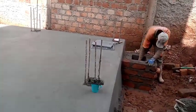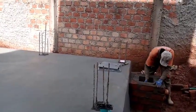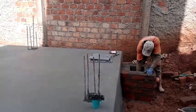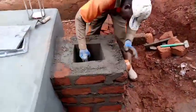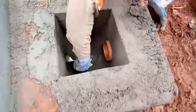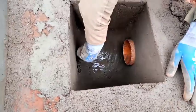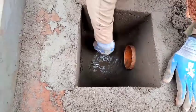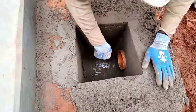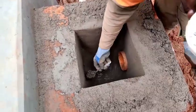You can see the texture, the smoothness, and how it looks. Notice the pillars protruding — that is because we will be having a tower on top of this tank, and possibly a house. Today we decided to build the inspection chamber or manhole. What we are building is the port, because we have to extend it so that whenever water comes in, it passes through a port before entering the tank. The purpose of that port is to catch any debris or material that comes in from other sources.